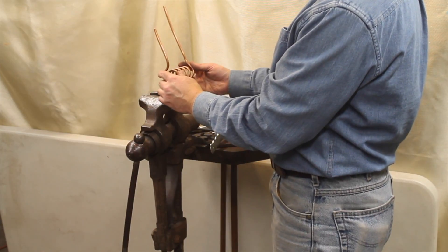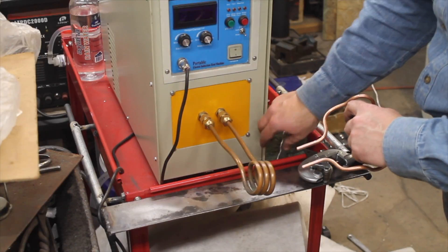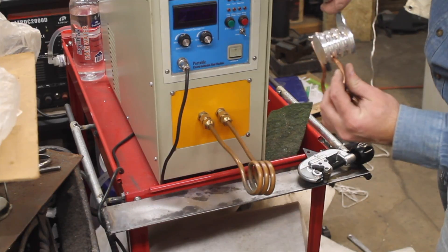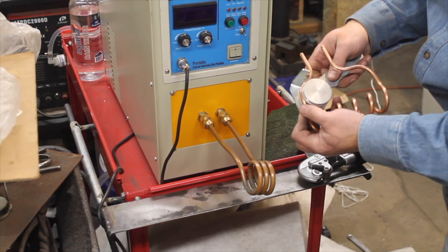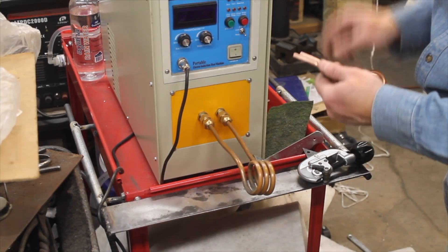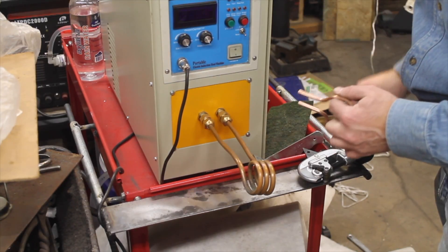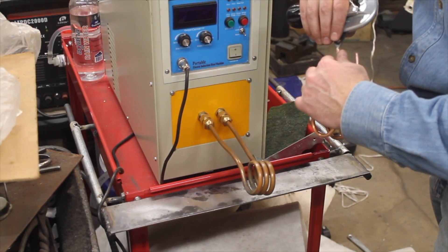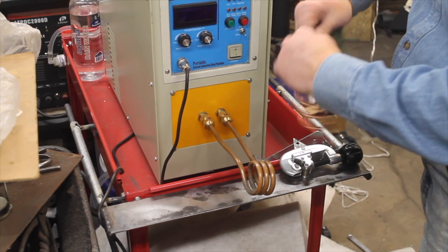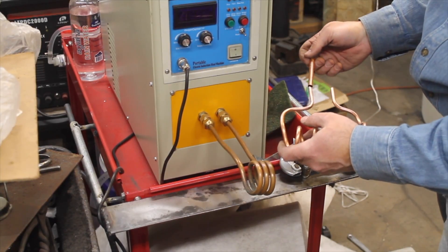Looks pretty good. I used the bender to bend the leads first out and then bent them in so that they would line up parallel. There's the unfortunate asymmetry, and if I had measured twice and cut once it would have been better. I also needed to file off the ridge that was raised from cutting and do the same thing with the interior just to ensure good water flow. And since I'm soldering, I'll scuff all the oxide off the copper.